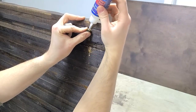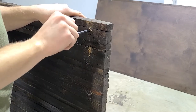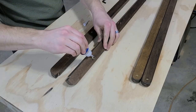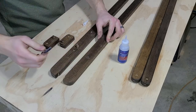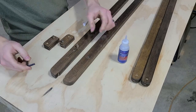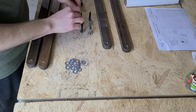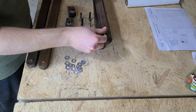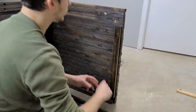We used to use tape for depth stops, but we found these cheap rings are much more reliable. To make sure these inserts don't back out over time, we give them a drop of super glue before screwing them in. We then repeat the same process to install the threaded inserts into some of the holes in the linkage pieces. We use washers to keep the wood surfaces from rubbing and ensure we get smooth actuation, then pre-install our shoulder bolts and check their fit. If everything checks out, then we are ready to attach these to our frame.